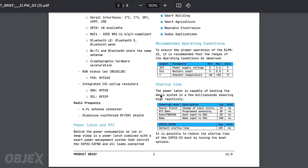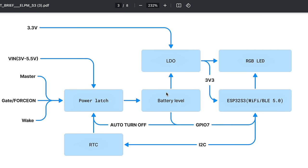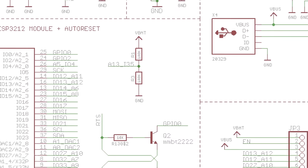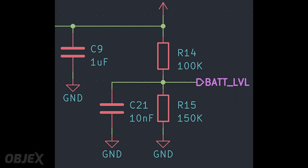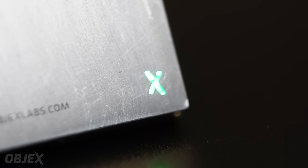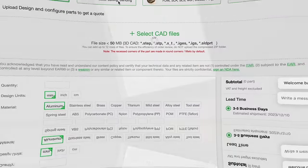Also included in the module is a battery level circuit. You can connect a battery to the VIN input. This circuit has zero leakage current because it only takes readings when the ESP32 is powered, so it's not connected directly to the battery. This sounds like an obvious feature, but trust me — most development boards and smart products have the battery level circuit always connected to the battery. Since the circuit consists of a voltage divider, these two resistors draw some micro amperes. Another feature is the status LED under the object's logo, which also has zero leakage current and no effect on energy efficiency.